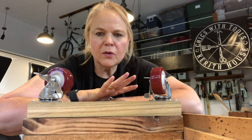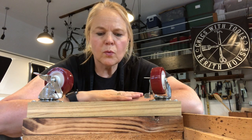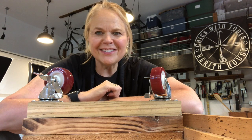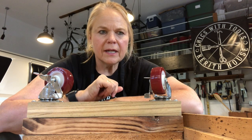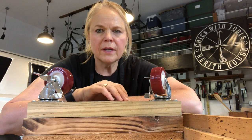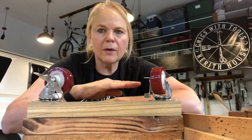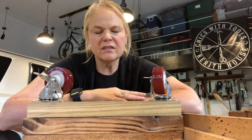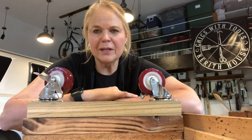My client wants this unit to be at comfortable bar top height. She's on the more vertically challenged side, so we didn't need it to be more than about 38 inches. The first thing I did was take off the cabinet doors, take out anything loose, then cut two different layers of wood to get the height I wanted, including these new wheels. I actually broke one of the old wheels, but these new ones are pretty sassy because they're the red that my friend likes so much.